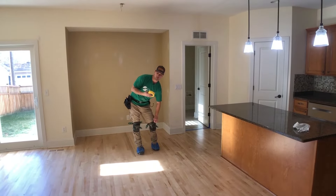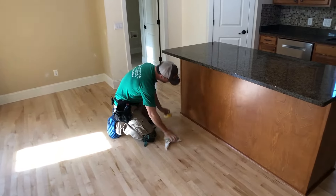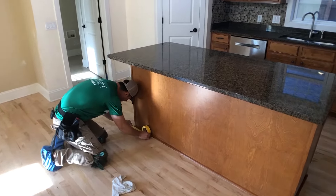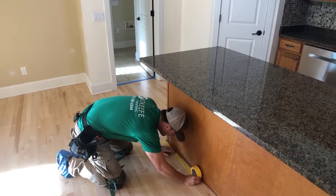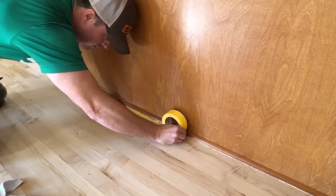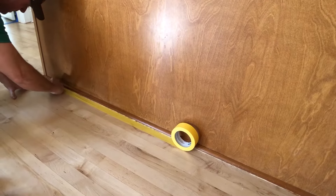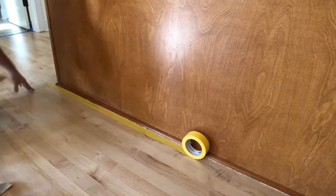It's important that everything is lined with this yellow sensitive frog tape, especially here since the floors have just been refinished. This is better for release on a sensitive surface — you don't want to be using blue tape or inner tape on fresh hardwood floors. Have a rag with you to wipe off the floors since they'll be dusty, so your tape sticks good. Keep it real tight in here. Before sliding over, take your inch-and-a-half knife and lightly press down on that edge to make sure it's sealed.